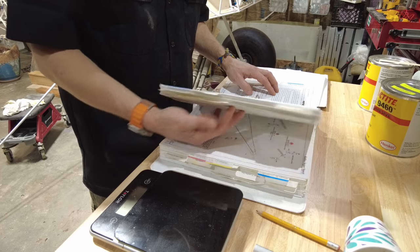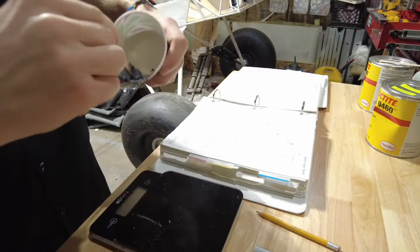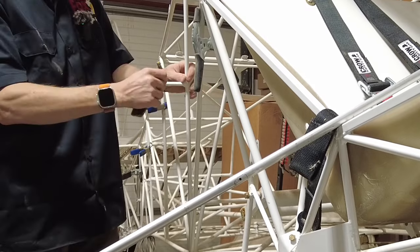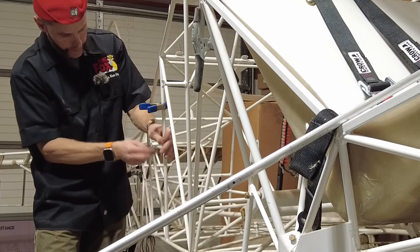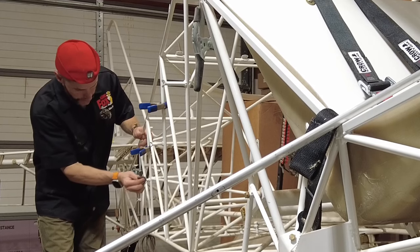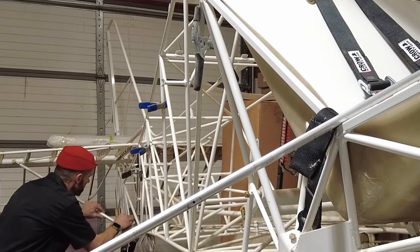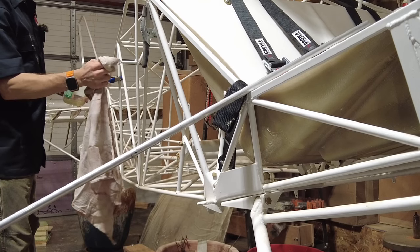I'm going to mix in a small quantity of micro balloons — that stuff is like flour. Then I'll rough up the fuselage attachment points. Starting with the forward one up here, I'll give it a light touch with the Scotch-Brite. The book says this gives it some 'tooth' so that the glue has something to stick to. When I'm done I'll wipe it with some MEK or denatured alcohol to remove any contaminants from my fingers. It doesn't take much — you can see the paint scuffs almost immediately. I'll scuff the back piece too where it's going to get safety-tied with wire.